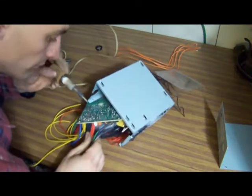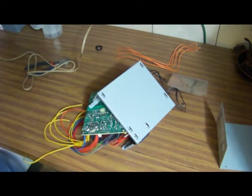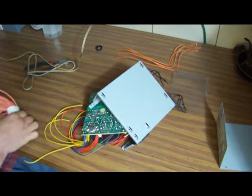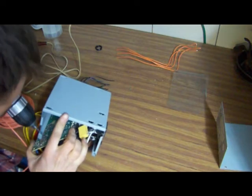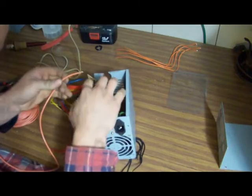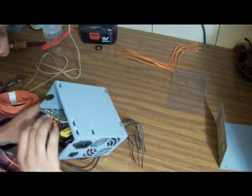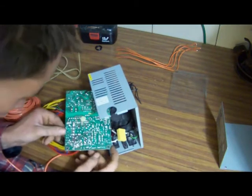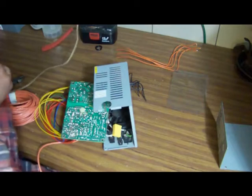Now take note of where those went out, because you'll need to put another wire in there, in which case you can put a heavier wire. I just so happen to have 12 gauge orange, so we'll use that. I'm going to push my 12 gauge wire through the hole that I just drilled. Simply get it to lay reasonably straight — if it's going to be slightly crooked, make it crooked in the direction facing the other holes.